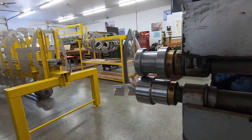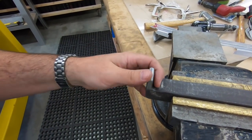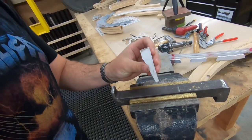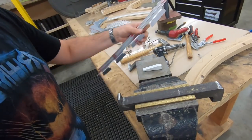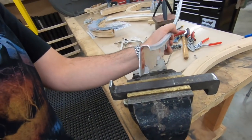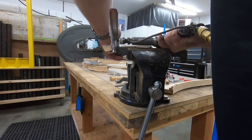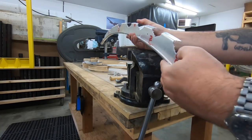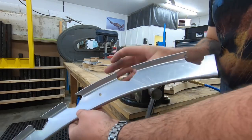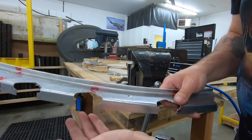This top flange needs a little bit more work still, so we'll go back to the bench. I have a series of bucking bars that I've modified as dollies for shaping the fuselage components, along with a couple of little plastic punches and things like that, which really help out to get some of the tighter curves. In this case I use this one for that last little bit — if you look down low, that secondary bend is not quite 90 degrees, so we're going to make it 90 degrees. Now we've got a nice straight edge, a nice even bend, the dies have made a nice face there, and we've got a nice 90 on there. Ultimately we've got a fairly nice part.